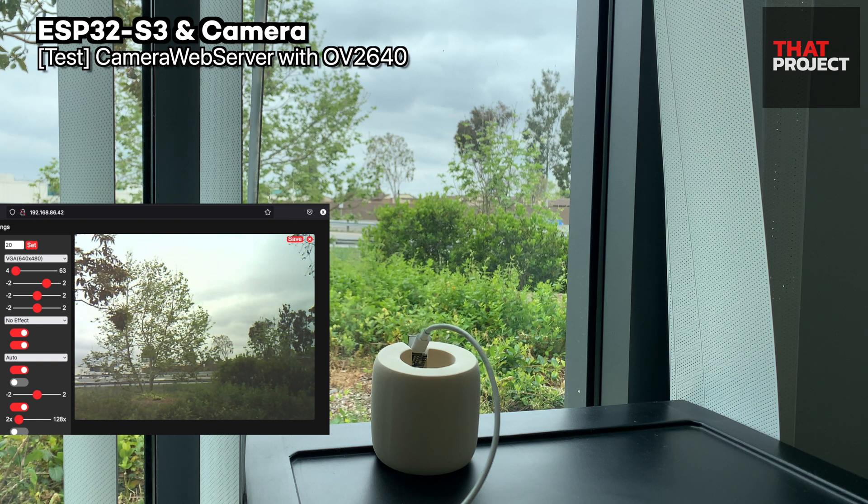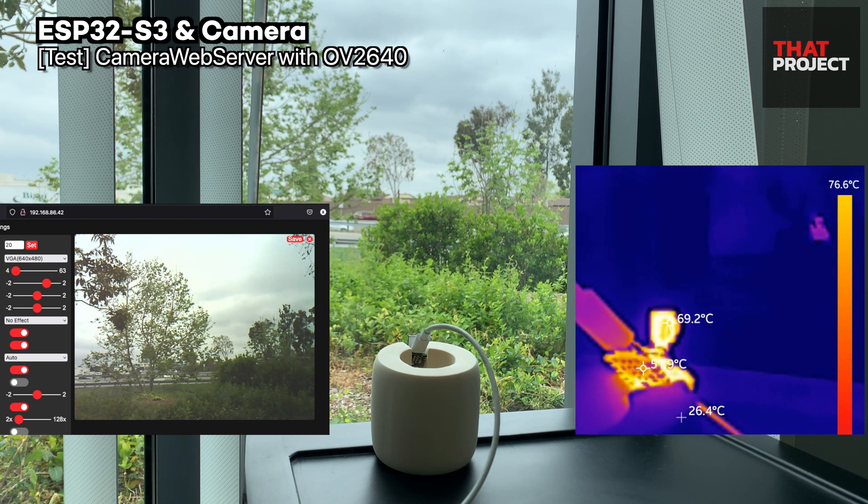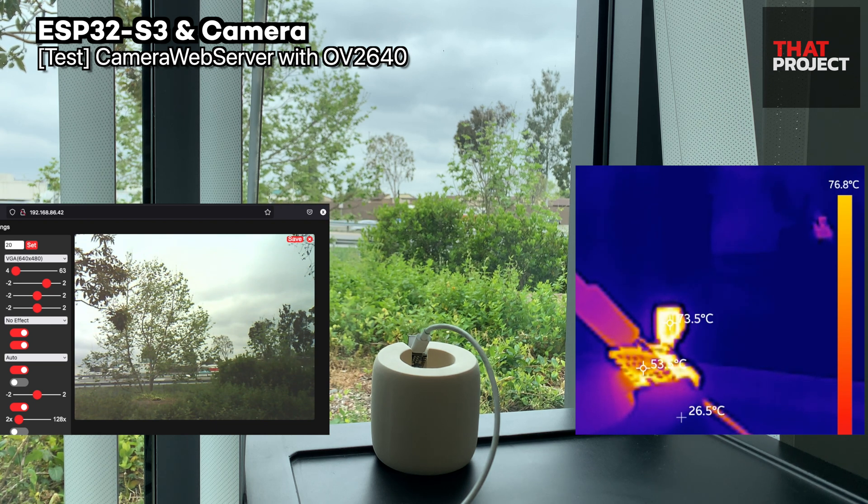It's working very well without any problems. Since this device is made very small, I thought the system could be slowed down by heating up if continuously operated — because everything including the regulator is tightly packed inside one main chip, the ESP32 can get hot more easily and that will eventually slow down the system. On the right I'm taking a system temperature measurement while it's working. I expected the regulator on the main board to be the hottest, but the OV5640 was the hottest.